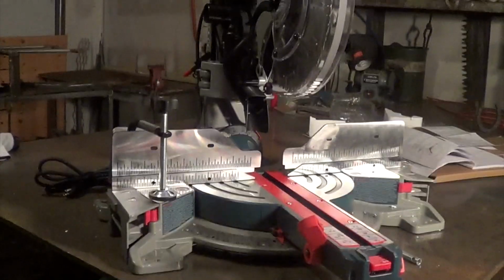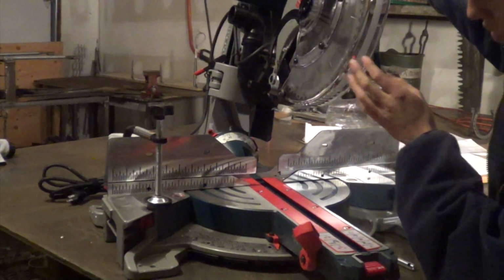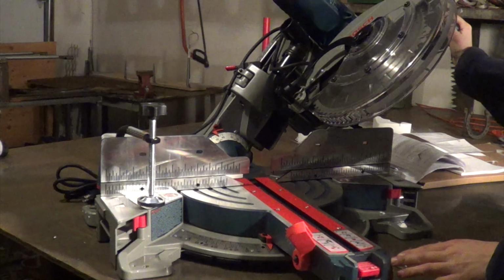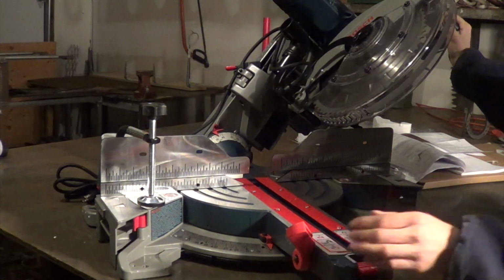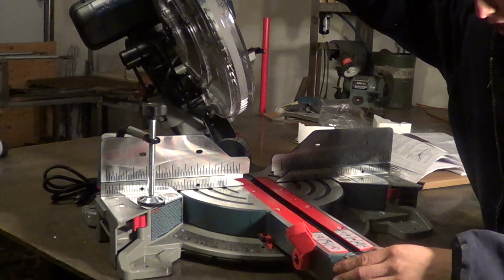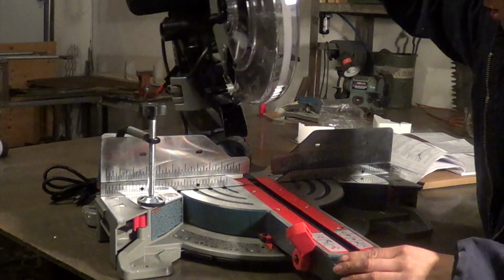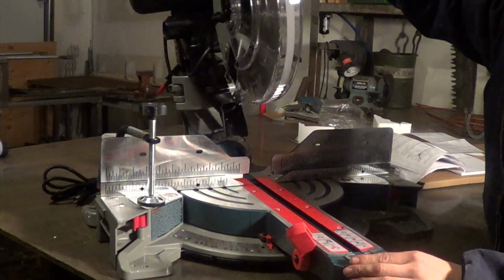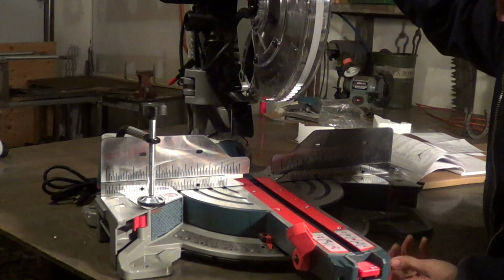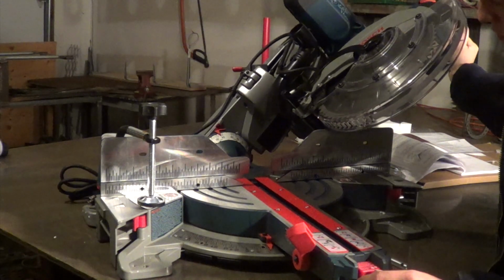And now all I'm simply going to do is move this saw to the right. Granted, this knob is only on to the right now. If I wanted to, I could... oh wait, actually look at that. This knob actually automatically shifted back to the 0 to 45 degrees left, so I'm going to start going right again. And that's interesting, it actually locks. So if I want to go to the right, I'm going to hold down to the right. It can go down to 45 degrees.